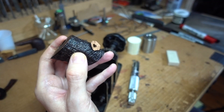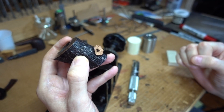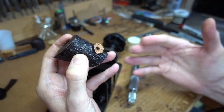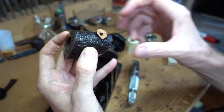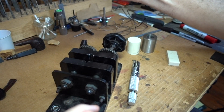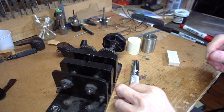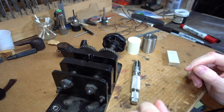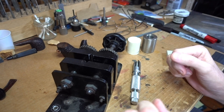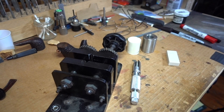We will glue it together and then drill — and then things are in rigid alignment by definition. Do not drill before gluing; you will regret it. I'm going to turn off the camera, actually glue this up, and then get back with you for the next step after the glue has completely cured. It takes 24 hours. All righty then — thank you so much for watching.